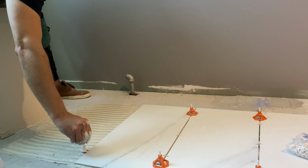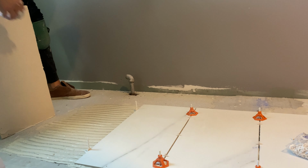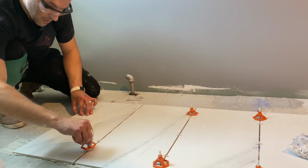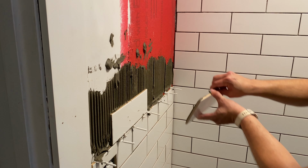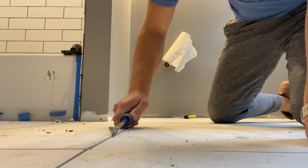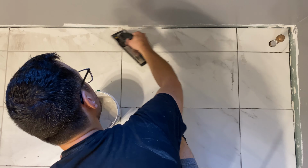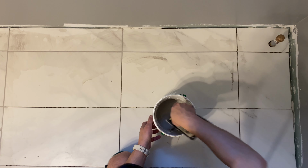I did use this leveling system that was pretty neat though. Pretty much you place these peg things in each corner and then you tighten down the orange leveling cap to bring everything flush with each other. These are great and I'll leave a link to them in the description. When all the tiles are done, we wrap up with some grout and the bathroom is finished.